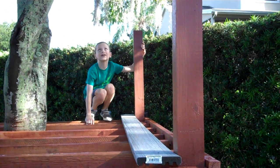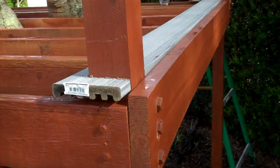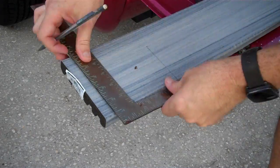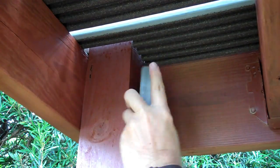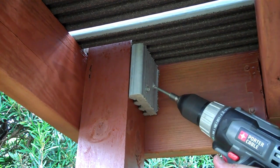You have to cut out gaps for the 4x4 posts. You could make L-shaped cuts instead of C-shaped cuts if you don't have a jigsaw. The extra piece at the end just looks nicer when installed. I just drilled two holes and chopped out the section with a jigsaw. Keep in mind you'll need a bit of scrap under the cutout to provide structural support for that little section.